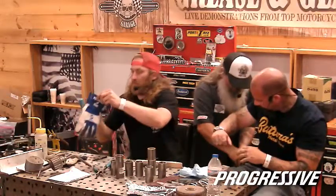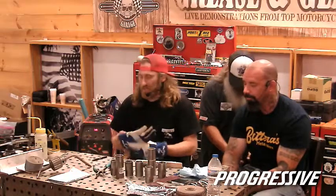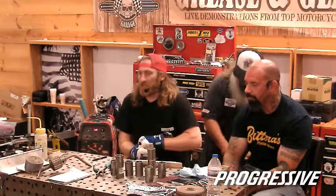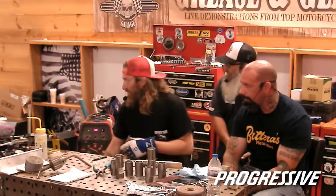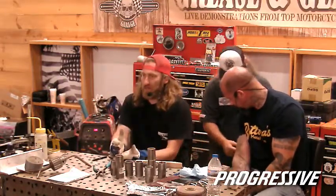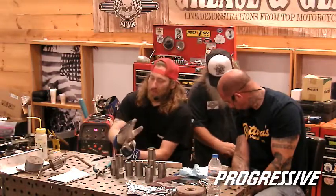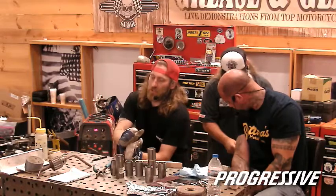Being able to cut off the pedal and have that range is almost a necessity. What he's saying as far as range, if you set your machine at 200 amps and it's a 200 amp machine, pushing your pedal full throttle will be 200 amps. But now it only pivots so far back. So from that angle, that range, you have 200 amps to play with.